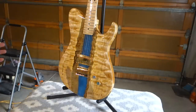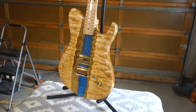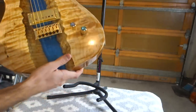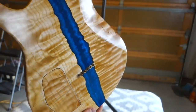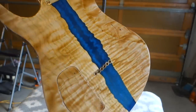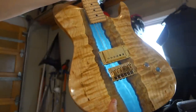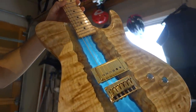I'm really happy with how this guitar turned out. I wasn't sure how it was going to look when I poured the epoxy, but after shaping, sanding, and dyeing the wood it looks a lot better than I thought. The quilted maple is awesome — it was my first time working with figured wood, so it was a learning experience in terms of dyeing and sanding it back. After the clear coat and polishing, it has an awesome 3D-like effect; the grain looks totally different from one angle to the next. The river turned out really well too — the blue resin on the bottom and clear resin the rest of the way really resembles a little river canyon.